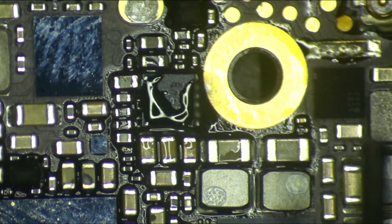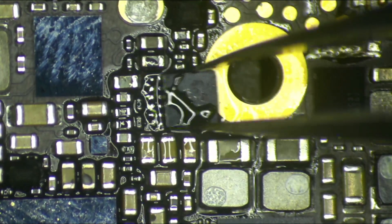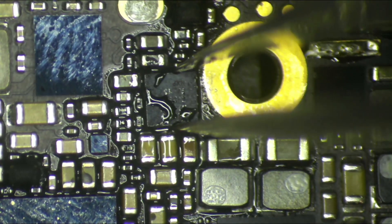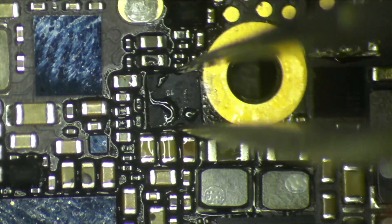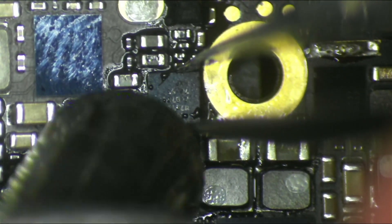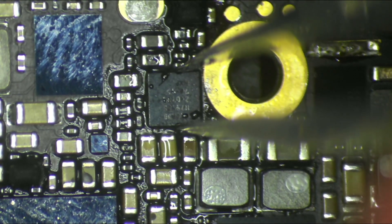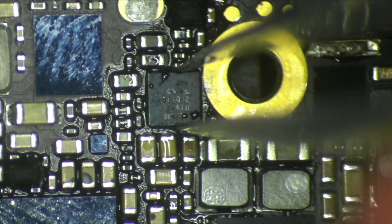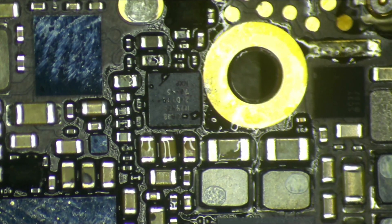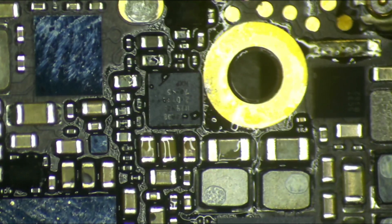You should wait and not be impatient like me — it's not actually stuck yet. Let's come back in here. We're going to pin it down with the tips of our tweezers, come in with a bit of heat, then take away the heat and give it a couple of seconds. I'm a dickhead — I didn't change my temperature on my hot air. We're going back up to 385. Making live mistakes. Stuff happens.